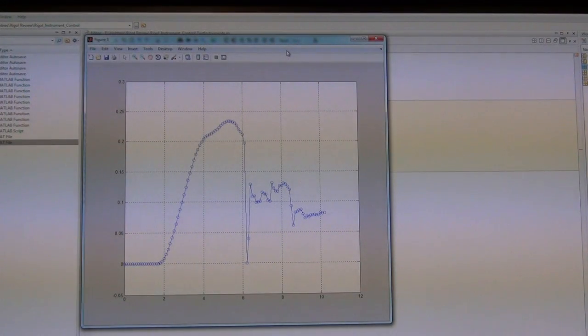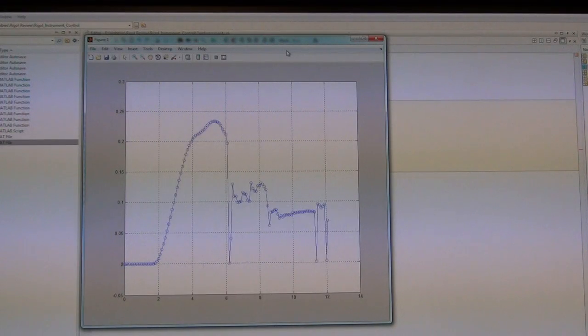How much longer? It's now at 10 volts and at 82 milliamps. So now it's actually more interesting, because the voltage is going up but the current is staying constant. And it has these dips, and I think as the temperature goes up, there's an equilibrium between temperature, voltage, and current that it has reached. So now it is still doing strange things. There is no light anymore. There we go, and it just died. So at 12 or 13 volts, it finally gave up.